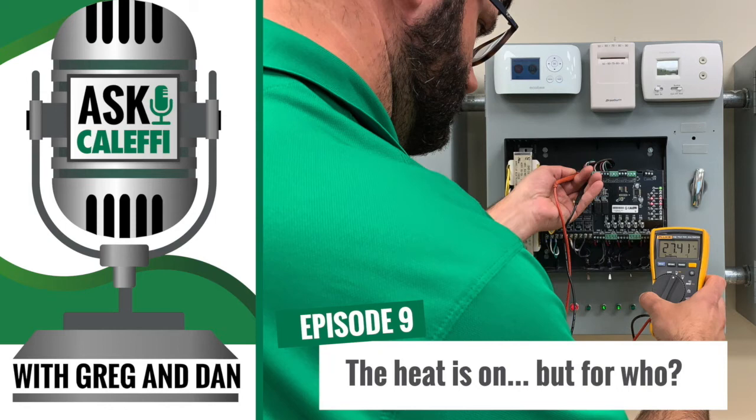Getting back into troubleshooting — number one, you want to locate the cause of the power loss. That's really what we had to do. It sounds easy, but by isolating everything off — thermostats, zone valves — then you're plugging one component in at a time. You can go one thermostat and one zone valve: start with zone one, plug them in, make the call for heat. If everything kicks on, the pump runs, and it all works without overheating that MOV in there, then zone one's fine. Continue that process, keep going down the line until you find the one that trips the board out.